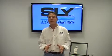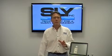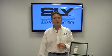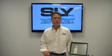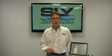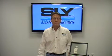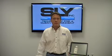First is proper startup using a pre-coating material. As I mentioned earlier, Sly recommends using Precoat brand conditioning agent. Precoat forms a uniform, three-dimensional, porous dust cake that is ideal for efficient and effective baghouse operation. Due to its multi-walled, curved structure of varying sizes and shapes, Precoat provides a natural, well-balanced particle size distribution that promotes increased airflows, thus reducing differential pressure and, in turn, energy costs for operating your dust collector. You'll also use much less Precoat than any other types of conditioning agents.